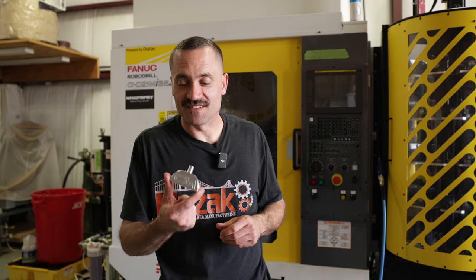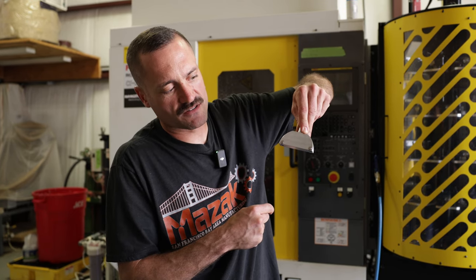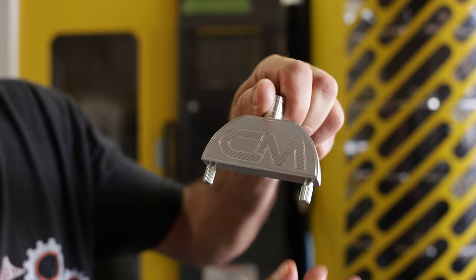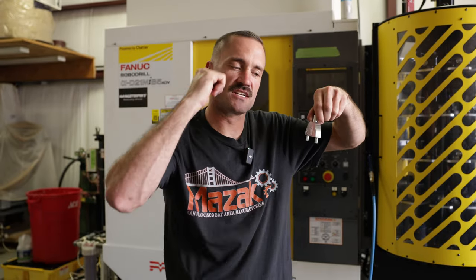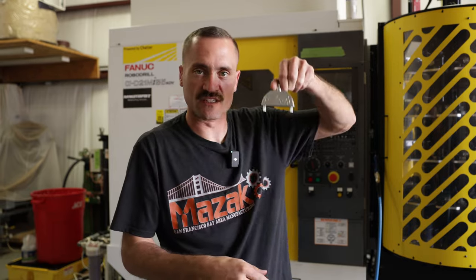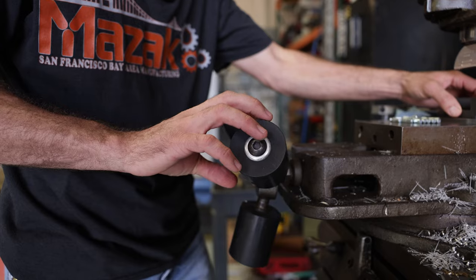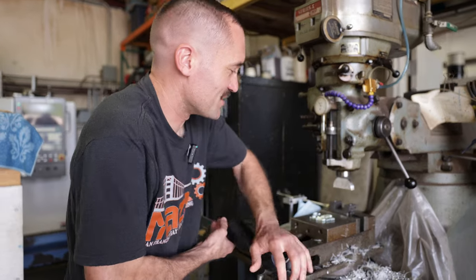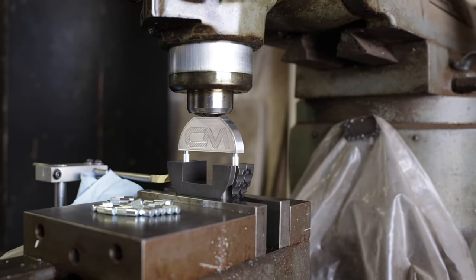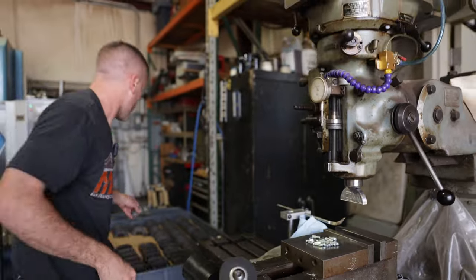Through the power of editing, this part is made. We machined it, pressed in and used a little bit of Loctite on those magnets. To demonstrate the purpose — these little pins have a slip fit with about a thou and a half of clearance — so it grabs those pins so I can then press them in on the Bridgeport as we go through and assemble a bunch of parts. It makes it quick and easy. Hopefully I won't get these pins canted or crooked and it'll be the same every time. Using that fixture we machined, we're going to press these pins in. Forgive the background noise, but after all we're a machine shop. Those magnets we glued in — boom — pins are there. It holds them, they're aligned, they're straight. It gives us perfect alignment. We press it in, pull our part out, and move on to the next part.